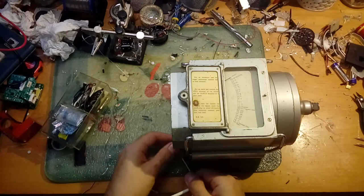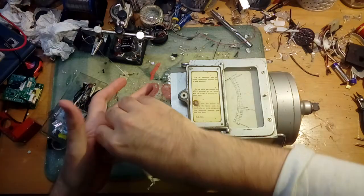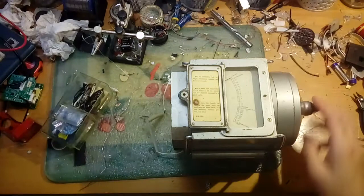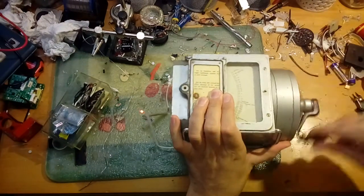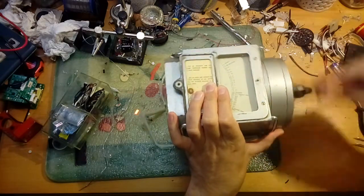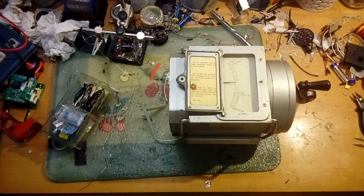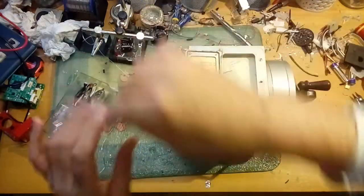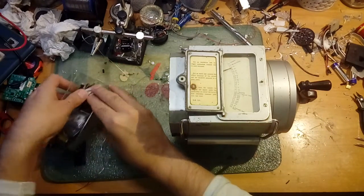It can also light a neon - let's try our neon box, which is depleting at a rather scary rate with all the neon projects I'm doing. Before we get into the full technical stuff, the accuracy isn't so great but you can see the neon light and it will drop down to about 100k. It's like an 81k resistor or something on that neon - these things weren't built for extreme accuracy, they were built to tell you if there's a problem.